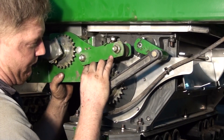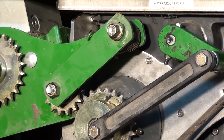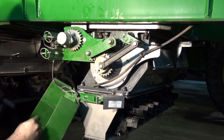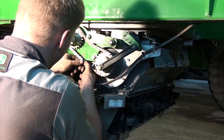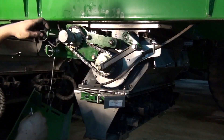Now we are ready to mount the hydraulic drive motor. We will install the bolt tucked behind the idler gear first and then pivot on that and add the upper bolt as shown. Once those are tight, we can reattach the side shield support cable. Next we will install the drive chain as shown, and then connect the electrical cable to the hydraulic drive controller and install the side shield.